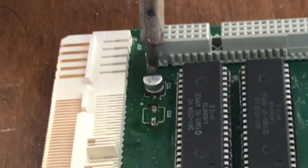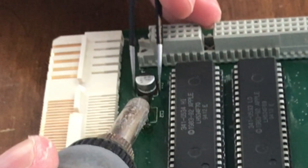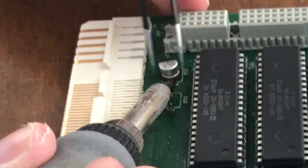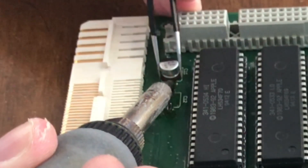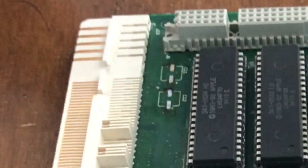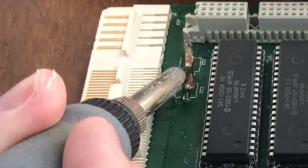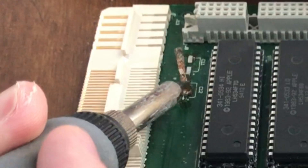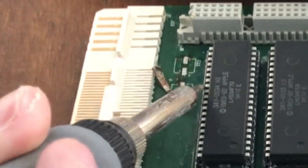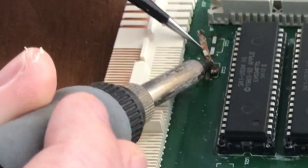In these cases you want to be especially cautious and not apply too much force. Try to remove as much of the solder as possible using the braid. And please remember soldering safety — have a fan running to extract the fumes from your workspace. Keep an open window, as you do not want to be breathing in these fumes, which consist of numerous toxic elements. A little bit of exposure probably won't hurt you though; it's more of a concern for people doing this as a day job. Now I'm cleaning the pads with solder braid, as the pads have old solder still left on them from when the board was manufactured.